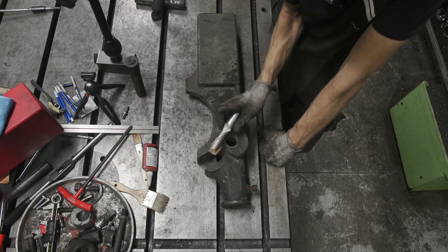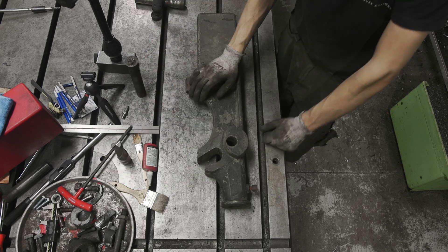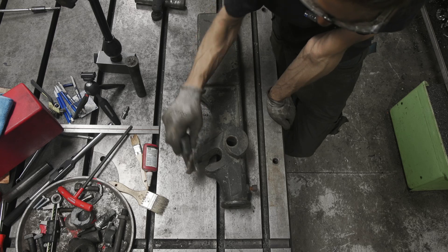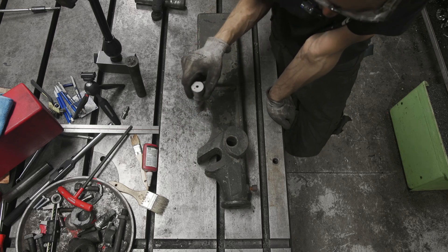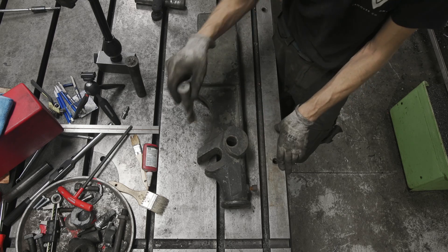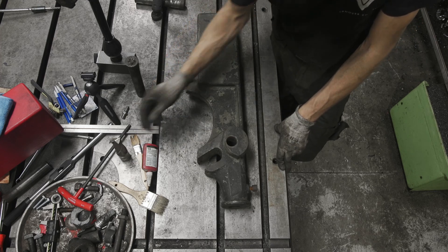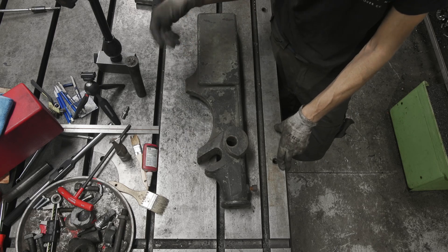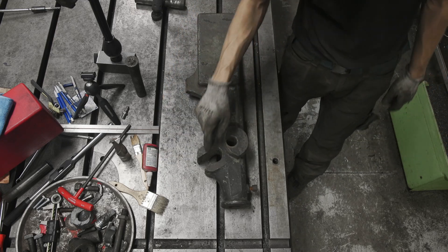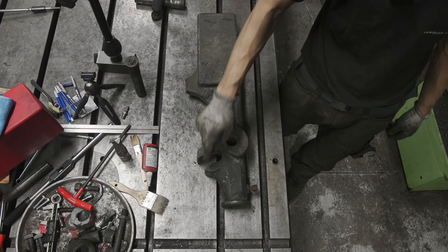What we do have is a one and a quarter inch cutter, which is maybe 60–70 thousandths oversized — a little more than I would like, but it is the cutter I have and it is deep enough to make it in one pass. Once we put this piece in I'm going to make sure it comes over farther, then we'll come in here and machine this pocket out with inch and a quarter, which should give us about 20 or 30 thousandths on each side of the pin. We'll start by getting this extra material lopped off — maybe in the bandsaw — and then get it over the K&T mill to clean up the pocket and get our piece of cast iron prepared.